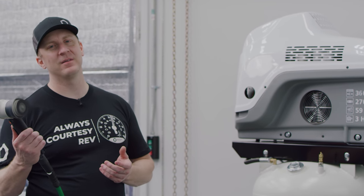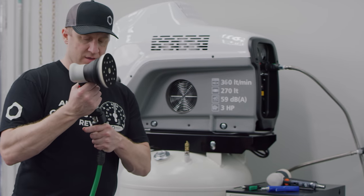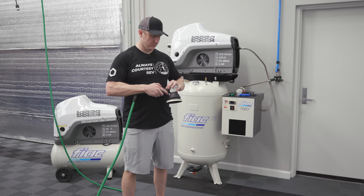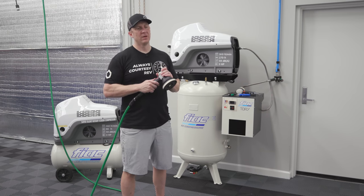As long as it can feed my polisher, this will be the most demanding device I have. The five-inch polisher requires about 12 CFM at 90 PSI to run all day. Now, if you had a six-man crew, this is not the right compressor — we'd want to size you a FIAC silent piston or a Jenny compressor. My Jenny next door had about 26 CFM output with tons of headroom.